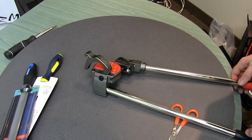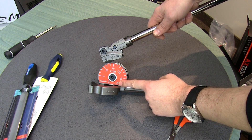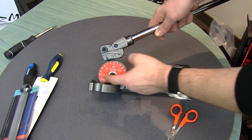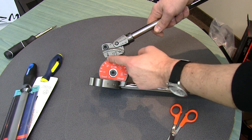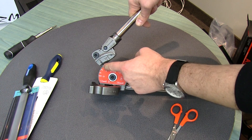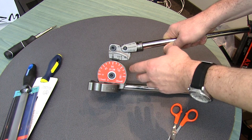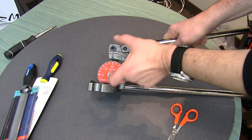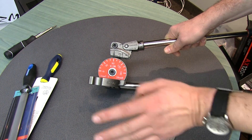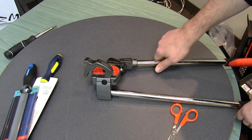Here's a close-up so you can see all the markings — it can bend as much as 180 degrees. There's a mark on the bender itself: you stop here for 45 degrees, stop here for 90 degrees. There's also a good manual that explains how to measure things so you can get exact lengths on each side. But right now we're not doing a real part — we're just going to ruin one tube.